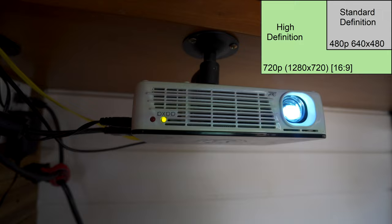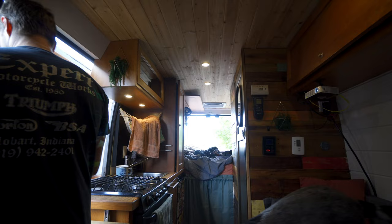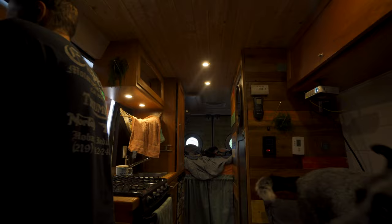The native resolution is 1280 by 800, which is like an HD projector — just not 1080 or 4K. That's why it's not as expensive as the other ones. It's not Bluetooth or wireless; you have to wire everything into it. It's 500 lumens, so it's okay in situations with some light, but it really needs to be pretty dark, especially if what you're watching has dark scenes.